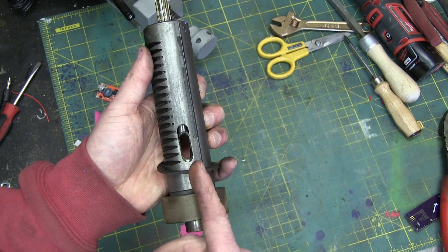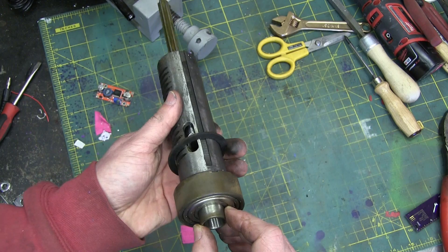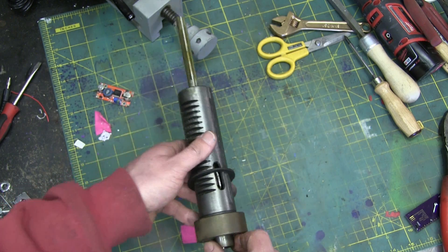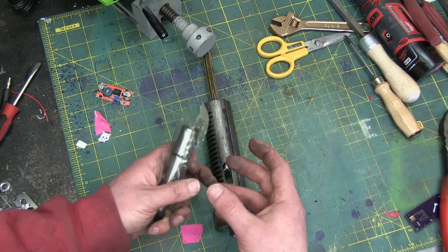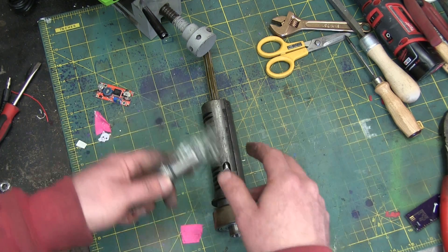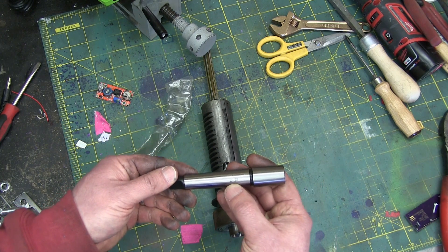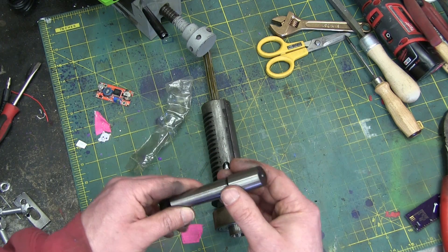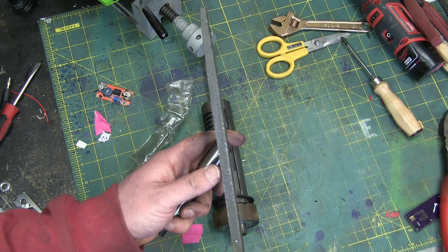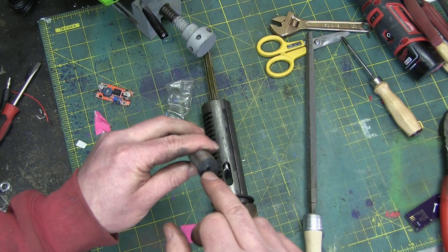If we look here — that's where the tang engages for the Morse taper. Now, how are we going to get a Morse taper tool to stay in there under radial loading? I have a Morse taper ER collet set coming — an ER collet is a proper machine collet with a spring and a nut. However, I don't have it right now. So I looked through the junk drawer and found a Chinesium Morse taper 2 to Jacob's chuck 3 adapter. It's even got the tang. And because it's Chinesium, it's cheese-grade soft — so I'm going to clean it up in the lathe for putting an end mill in there.